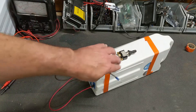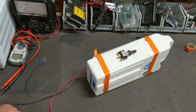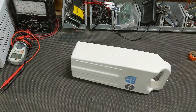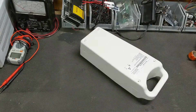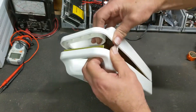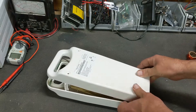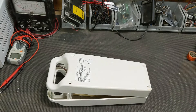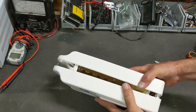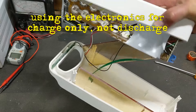Now I want to run these wires internally and solder them inside, so we leave the charge port open. That'll also leave this bottom surface flat so it'll stand up. I see batteries — they look like plain old 18650 lithium-ion, which is good in case we need to replace a bad cell; we can just swap it out. Hopefully we can get in here without breaking anything or setting anything on fire. These things have a balance board built in, so we don't have to worry about adding one of those.